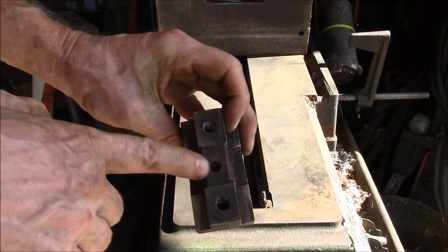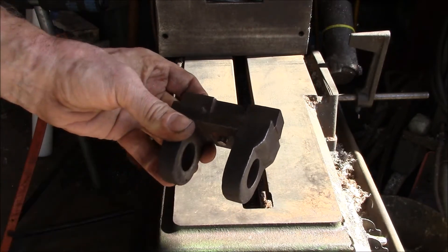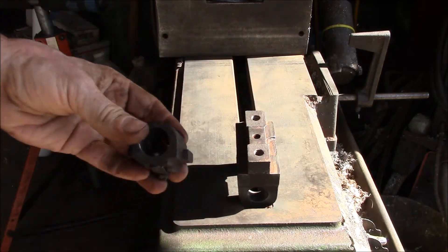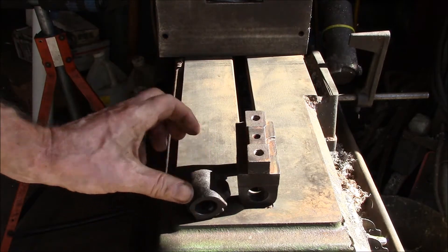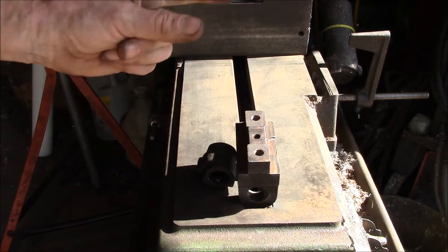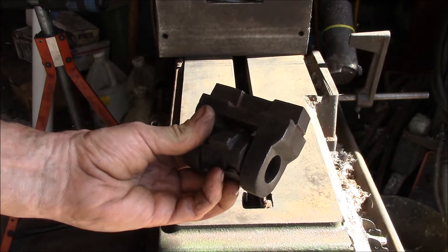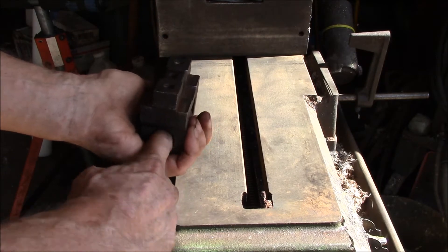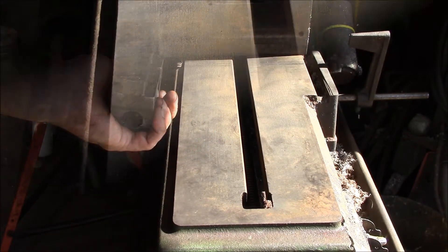The way this all goes together: you've got this little set screw here — that piece goes towards the hand wheel end. Then you put this pin also towards the hand wheel end. You put those two together like that, and you've got to hold that in one hand and then feed the lead screw through.